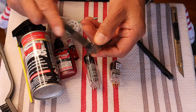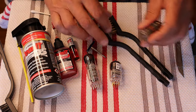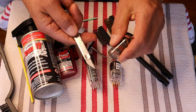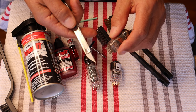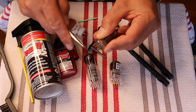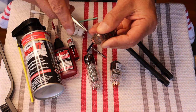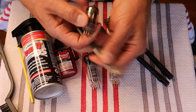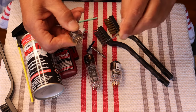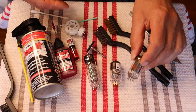The stainless steel brush will be much, much more aggressive and it'll take off the bad material quite quickly. Now, if you've got a lot of corrosion, you can use a low-angle blade — that's a less common type of blade in a box knife, but it's all we have on our benches because they can get into really tight spots. You can just essentially scrape the pin surface, getting in and around that corner, going all the way around once, and then come back in and just keep scraping. That'll make for a very, very clean scraped abrasive surface.